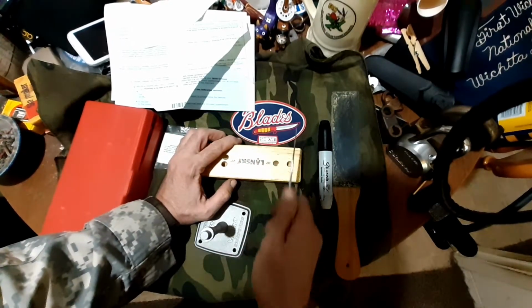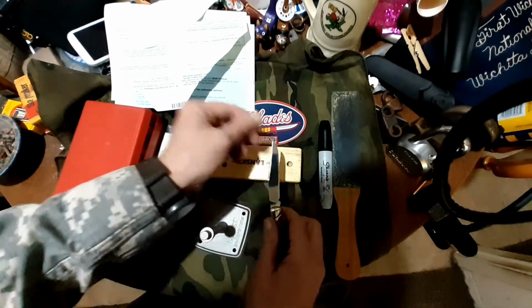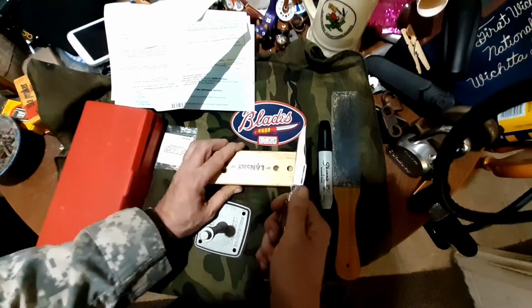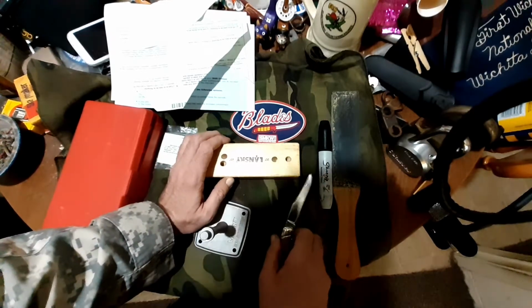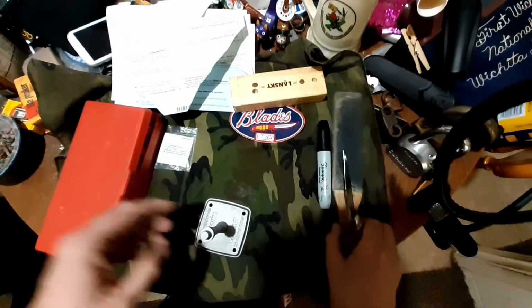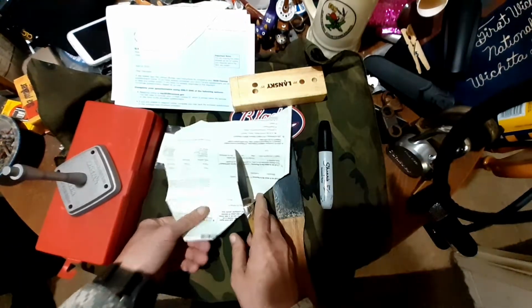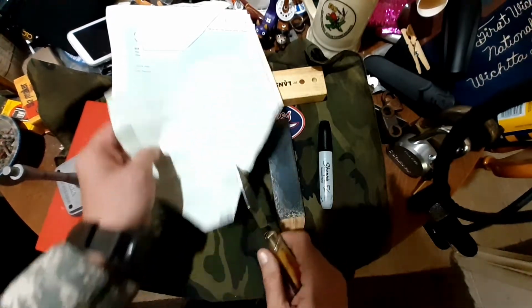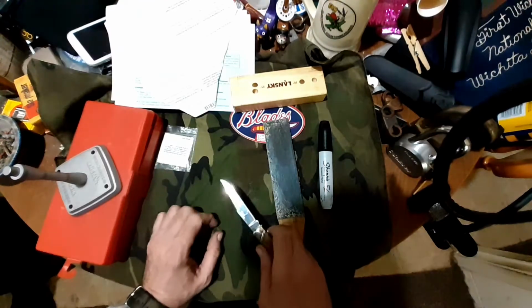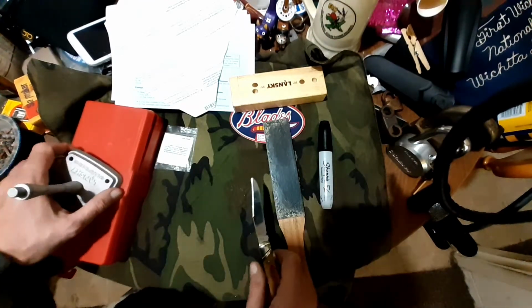to the other side. Try to do equal amounts on either side so that you don't form a burr, or you keep it even. And then usually just stropping it. That has been the biggest improvement to my sharpening, because usually I could get a workable edge and everything, but it'd be toothy. It would go through and cut, but there'd be areas that were just not straight. And if you tried to reprofile it or whatever, you usually mess up.